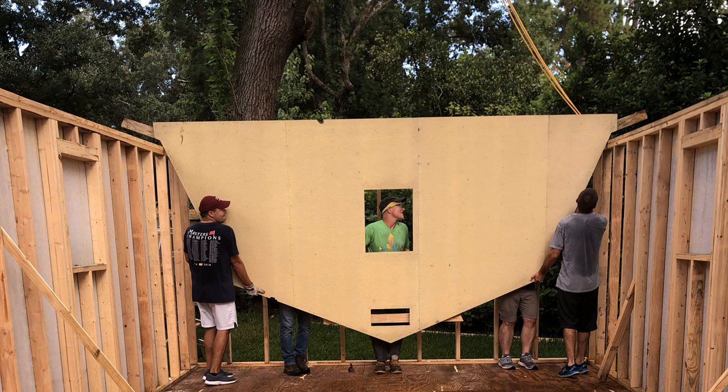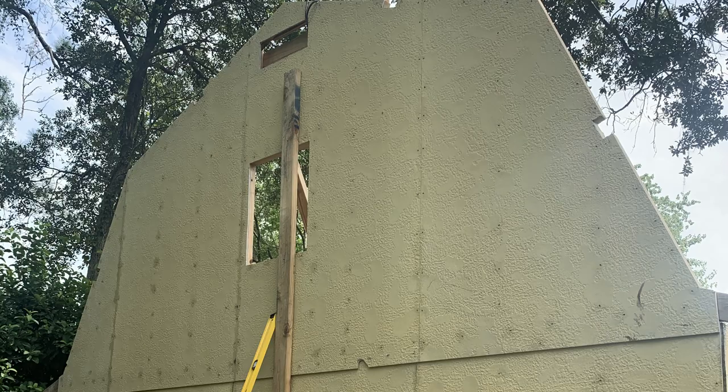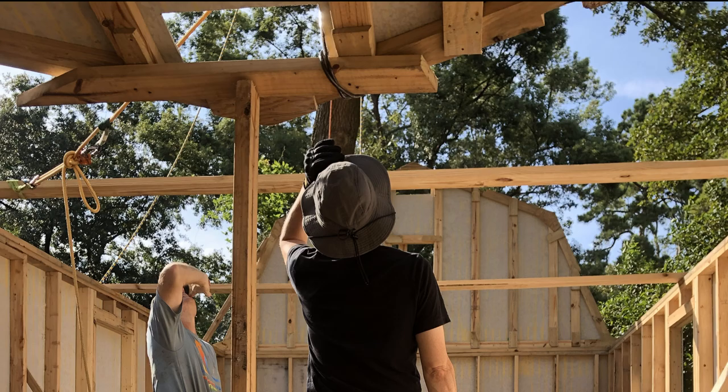Just kind of get them on the edge and work them into position so they're ready to flip vertically. You can see here how the hardy board is facing this direction — as you flip it vertically it'll be correctly put on the outside. Framed in the fourth wall so it can be used as support, and once that is in place you're ready to flip them vertically. You can already see I've cut out the holes for the windows and the vents.